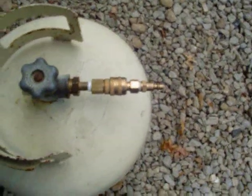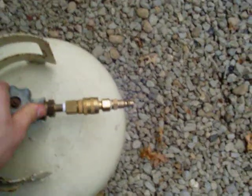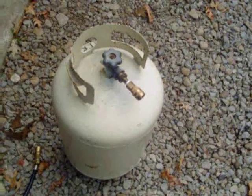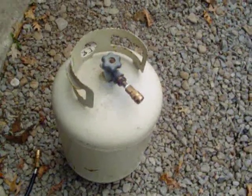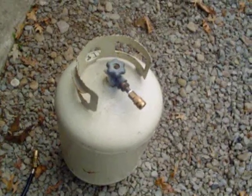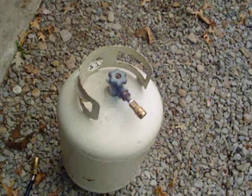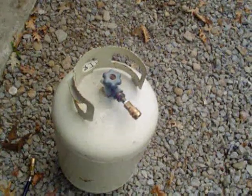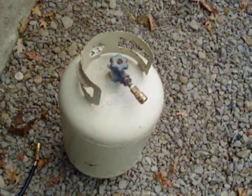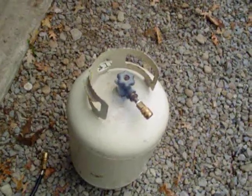With that fitting in there, you can just open the valve to empty the tank. Once you fill it up, you're ready to fill up your tires out on the trail. I've been able to fill four 33-by-10.5-inch tires from around 15 to 18 psi all the way up to 25 psi on one tank, filling it with about 120 to 130 pounds of air.